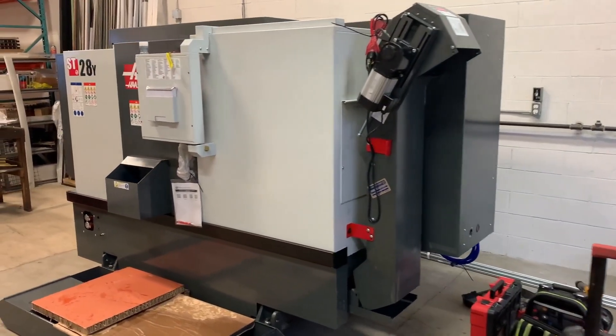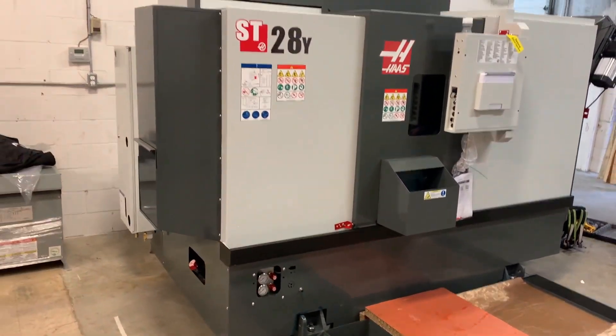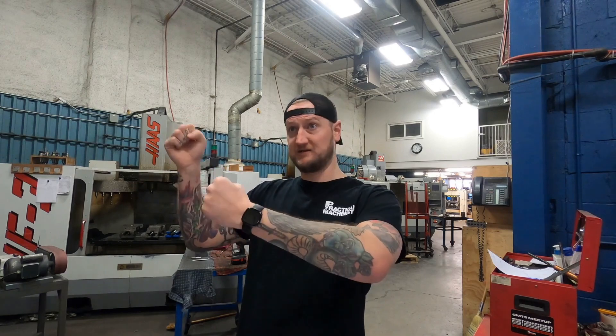Once it's moved in you're still not ready to go. The electrics and air need to get hooked up, and then if you're buying a new machine, the machine dealer or service company will come in and do what's called commissioning - that's step eight. Commissioning is when they actually unpack the machine: these things are shipped with shipping spacers and brackets to keep things from getting damaged. They need to level it, do all the boot-up, update the software, use setup modes to indicate things squared to each other and make sure everything works. For smaller standard machines this could take a day - for us it took a day. For really big tricked-out machines you could be talking a week or more.